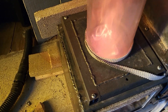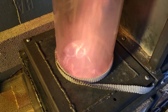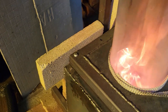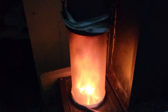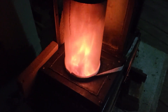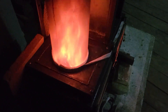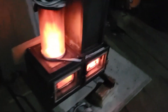It obviously starts to burn very well — you can see secondary air burning quite well as well as the tertiary air. It's very hot; I don't have my thermometer with me. It's been running for a few hours and gotten very hot, steel is all heated up in there. The tertiary burn with the fire bricks, especially on this side, needs more insulation. Wanting to reroute some of the steel to get it hotter — double it up so it has to travel longer. Overall pretty happy, should calm down quite a bit more once this new wood burns out.